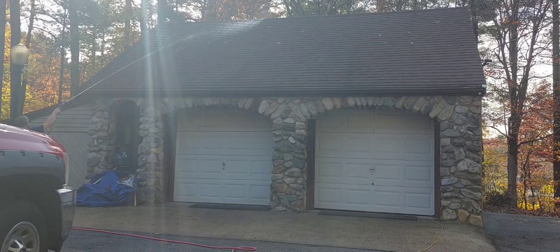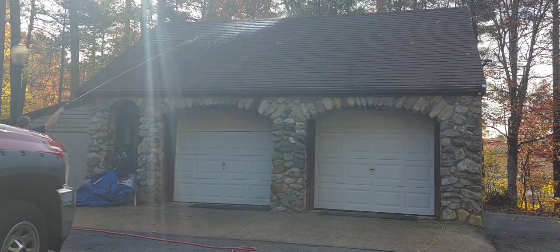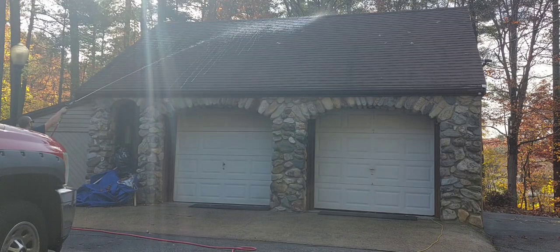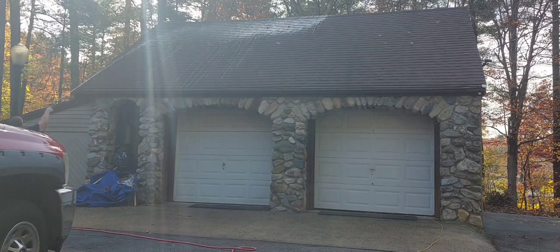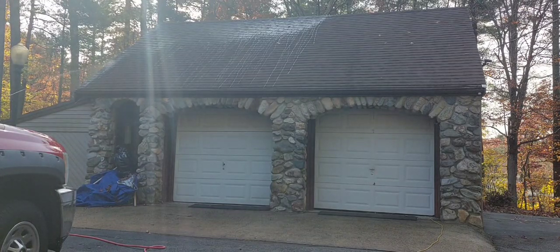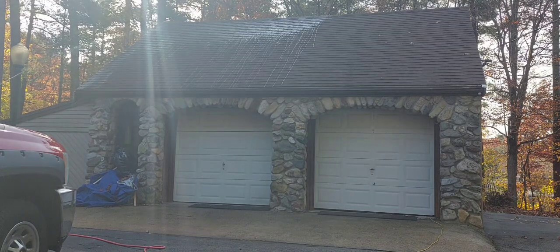And hey, I love the gas roof pump, but shooting some roofs, you're just gonna end up with too much overspray. If you got wooden decks around, a bunch of furniture, a lot of shrubbery, plants, obviously, you're gonna have a big issue with overspray. Or even getting just drip marks all down the vinyl siding. The house is dirty, they only want the roof washed, and now they're looking at their siding like, what the hell? Because now you got spots on it or drip marks from the SH.